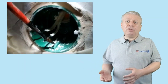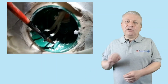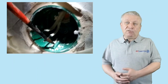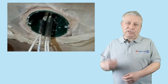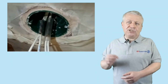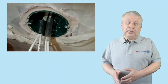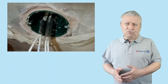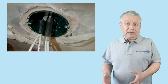Be careful when working with aluminum conductors — it is a very fragile material, and one careless movement will cause the core to break. After crimping, insulate the connection with adhesive heat shrink — the adhesive type ensures 100% tightness and in the future prevents oxygen from reaching the point of contact. To avoid burning the insulation, it is better to heat the shrink with a construction blow dryer rather than a lighter or portable burner.